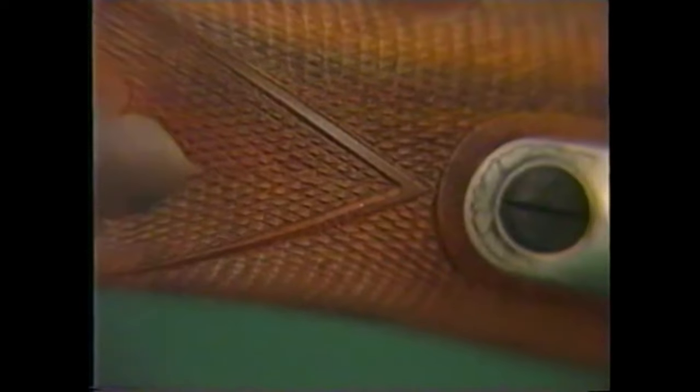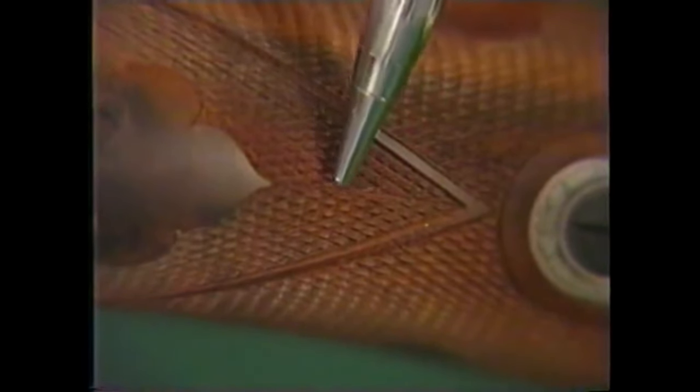This is a real good view of European-style express sights — continental style. The one standing leaf is in the center and then there are two folding leaves: one to the rear representing 200 yards, and the one in front that flips up to represent 300 yards. So you've got a fixed center sight for 100 yards, and flip-up leaves for 200 and 300. This sight is nicely inletted into the top rib of the barrel. You have windage adjustment left and right by drift, and the flip-up leaves are cut by the gun maker to zero the gun as the range is indicated. Also notice a little fine-line gold inlaid into the sight that draws the eye to the notch for the bead. The old-time hunters and gun makers found a way to store things by putting a neat little trap door in the butt plate, bored to accept spare cartridges — therefore you're never without ammo when you've got your gun with you. This is an example of checkering at its very, very best. Here we have the area under the grip, just behind the rear tang screw. There's a dividing line between the checkering patterns, and the result is you actually get little half diamonds. It takes a good checker indeed to keep those diamonds sharp and square and looking right.